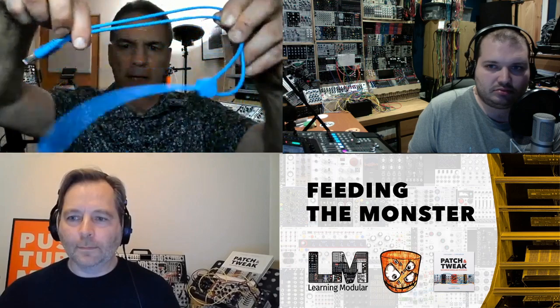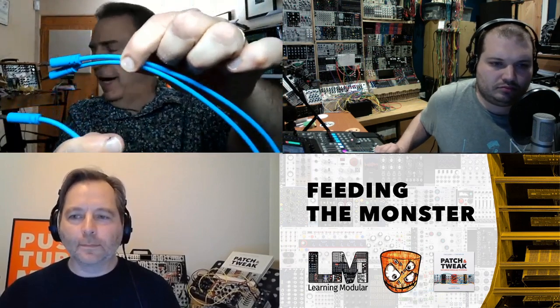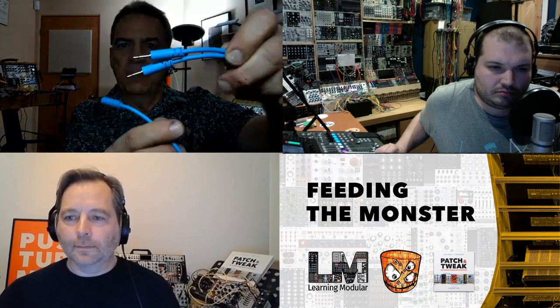That's cool. I tend to just split cables down into multiple mono VCAs. The reason being, I can offset them and change the CV depth differently, so I can create the stereo image at that point in a patch if I don't already have one. Yeah, I'm using these a lot, the Doppio cables. I love these for modulation because I just pulled it from my video case to the right here, where I was writing up the 4MS Spherical Wavetable Navigator, which has stereo outputs. And this is how I was controlling my Intellijel microVCA: one envelope, left and right channel.